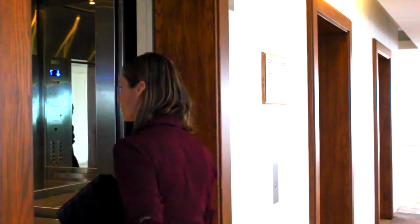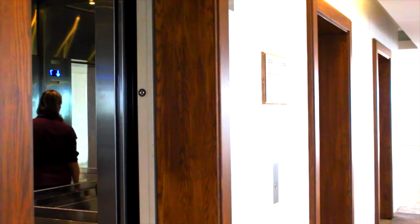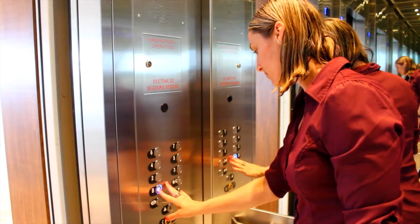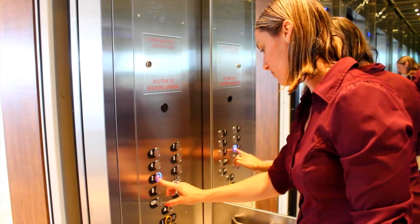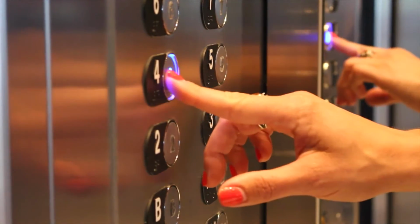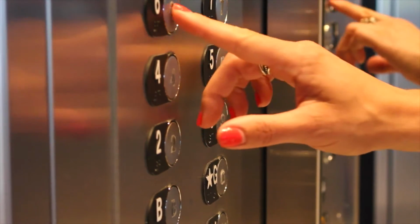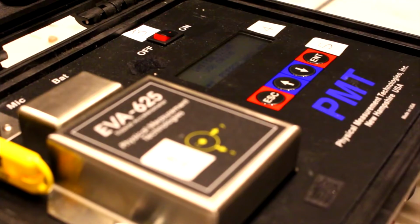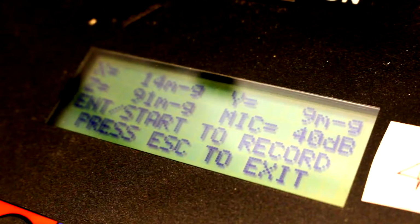Moving to the interior of the elevator cab, we observe its operation from the perspective of a passenger. We look for burnt bulbs and correct directional control. Elevator speed and accelerations can be judged by feel by an experienced inspector, but as a backup, a PM2 computer precisely measures and records all parameters in 3 dimensions.